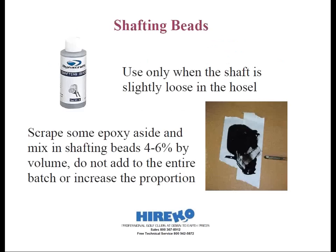Now, hopefully we've prepared enough epoxy for the task at hand. How long do you mix the epoxy? It's really impossible to over-mix, unless of course you're using fast-setting epoxy and mix for the entire working time. But the minimum should be at least 15 seconds for small batches and more for larger batches. Just make sure it looks consistent.